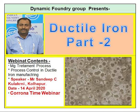Size, as I told you, 5 to 20, but again it depends on your treatment size also. What kind of treatment, how many kg of treatment you are doing, what furnace you have, what is your ladle size. All these things will also depend on your size, but the most popular size is 5 to 20. Calcium will be around 1.5%. Rare earth, that is cerium, will be around 1%. Then covering scrap will be 1 to 1.5%.